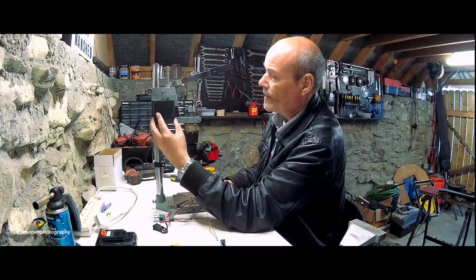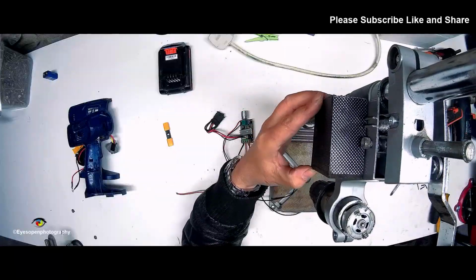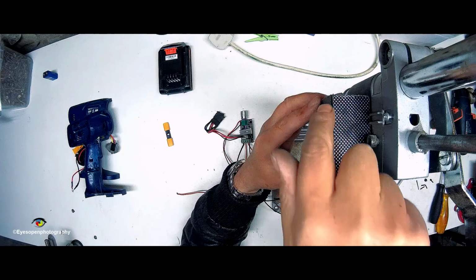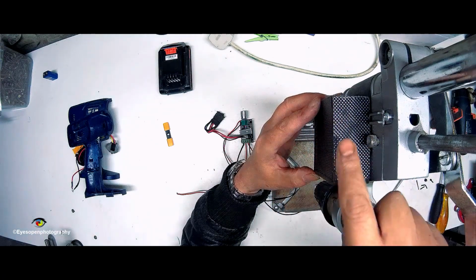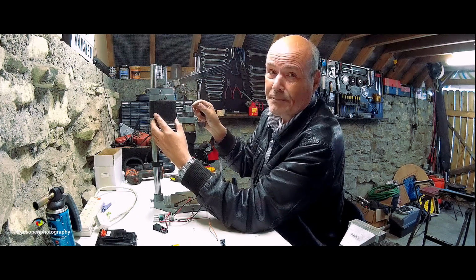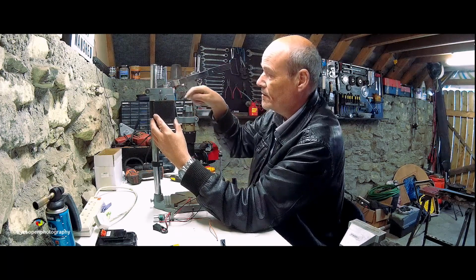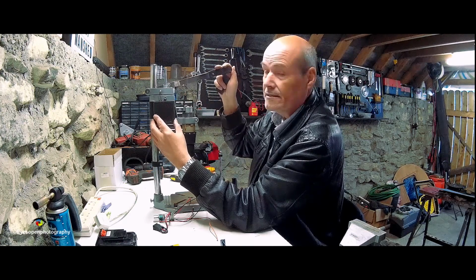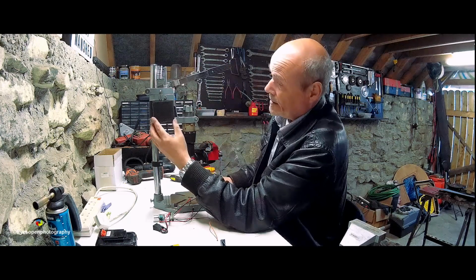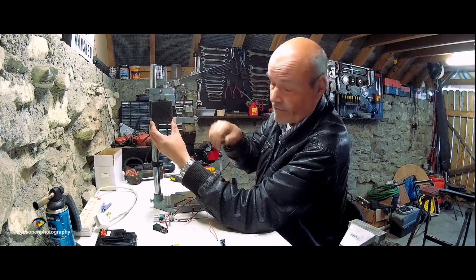Okay, so I have the switch and the control, and it will travel up and down with the actual drill. So there'd be no need for big long wires to come out of this and over to the motor, you know, the coil stuff you'd see on a cigarette lighter adapter thing for a car. That type of wire, I would use a small amount to just bring it over and make it look neat, and at least with the coil there'd be a little bit of give in it if you did happen to catch it with something. And I think that would look good there. And then have 2 extra wires going down for your battery.